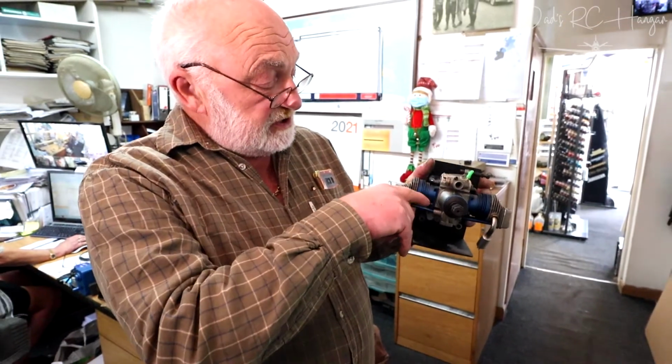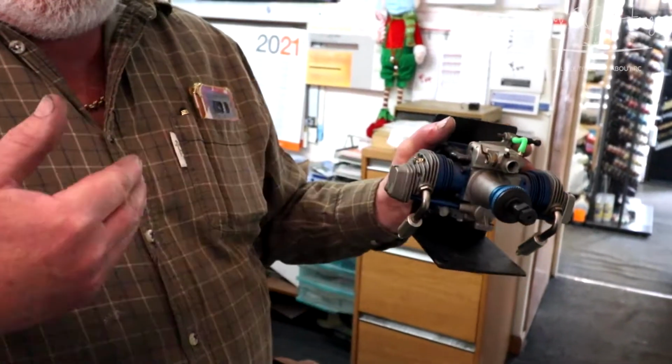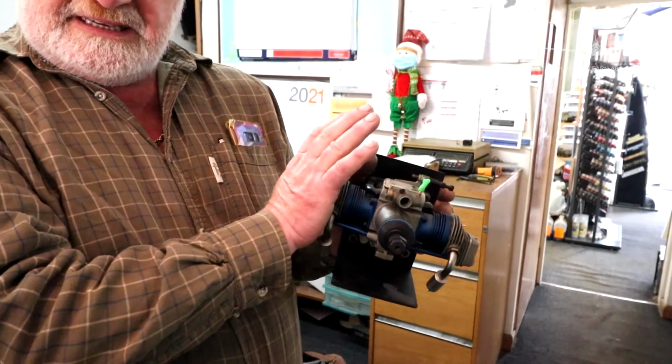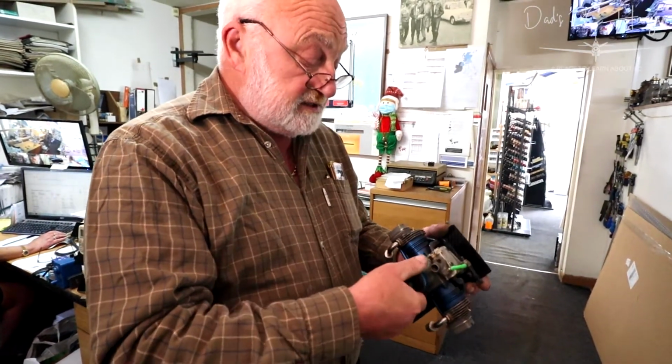So it's reed induction into the crankcase. Now, because it's a 4-stroke, the pistons come out and you're sucking in 1.6 cc's of air. Then you're compressing that, but you've only got one valve open, so you're not putting 100% in it, because you've obviously got losses inside the case, but you are getting more in it than you would normally get. And then suck blow goes in the other cylinder. So how much would that improve that engine, do you think? Oh, it was a noticeable improvement.